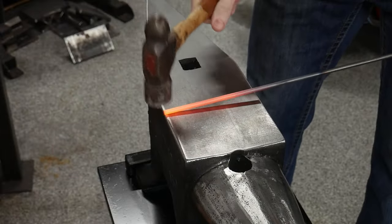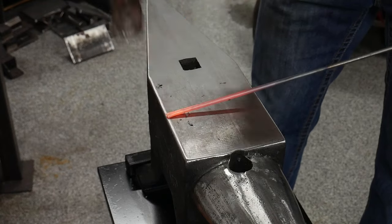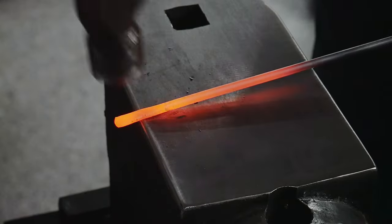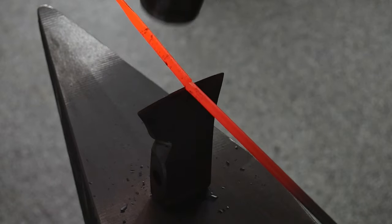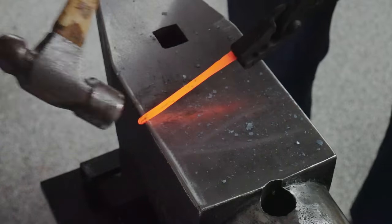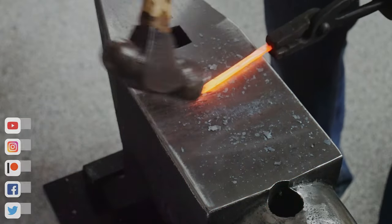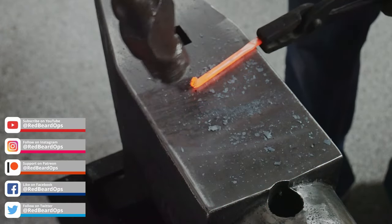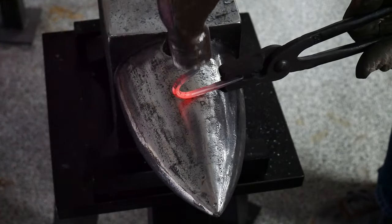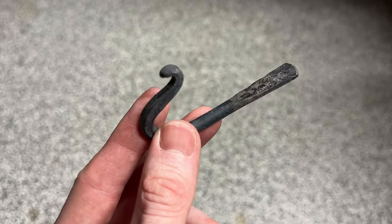I'm not an accomplished smith and have a ton to learn in blacksmithing and bladesmithing. The first thing we'll make is a little hook out of a quarter-inch bar. The hardy hole on this anvil is about one-and-one-eighth by one-and-one-eighth inches — slightly larger than the cutoff tool I made for my other anvil — but I got the stock cut just fine. While my hook is mediocre, the anvil did a good job staying stable throughout.